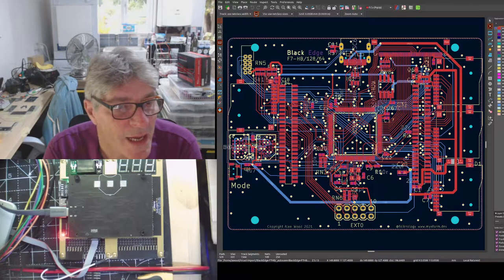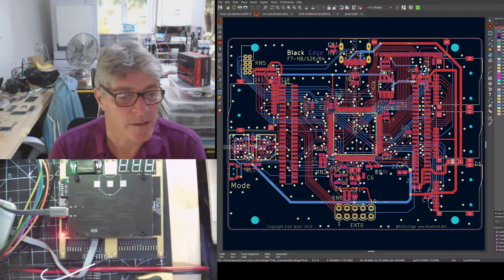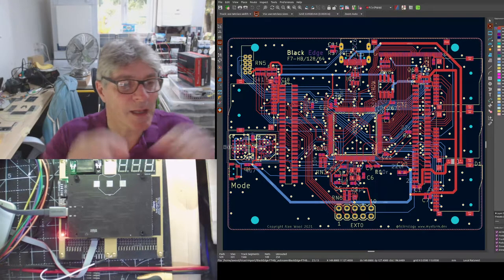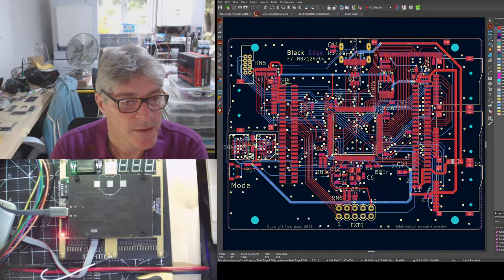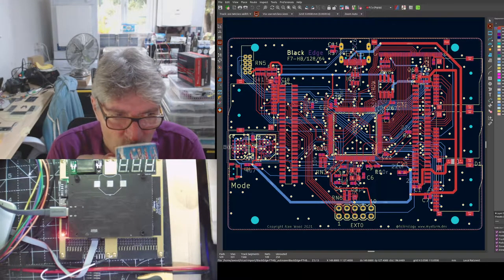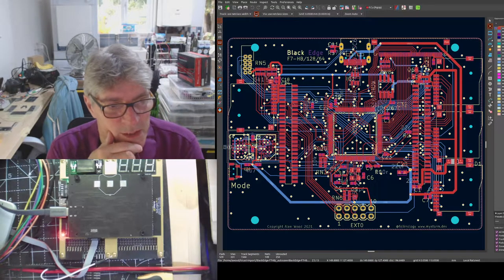I also had an LCD text display that needed 5 volt. All right, okay. Sometimes with LCD, you can get those little teeny tiny LCD 7 segs. Those are nice. Some of those need 5 volt as well. In fact, I think you're meant to generate plus and minus 5 volt for those, but that's another story. You most certainly need a larger voltage swing than 3 volt.